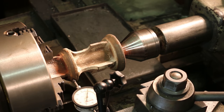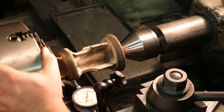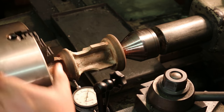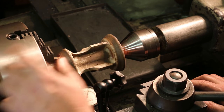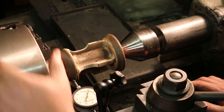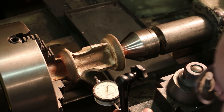We've got this thing set up over here on the lathe — in the four-jaw chuck with my big bull center. First time I've used this on the other end. Down here on this end, it's running within about two thousandths. I may try to fine-tune this a little bit more because I had it running within a thousandth a while ago. But we've got a little issue on the other end — about 13 thousandths runout. And I think the problem is that this hole that's drilled through here isn't exactly in center with everything else.